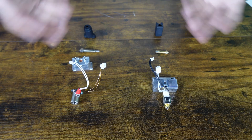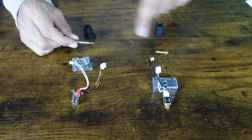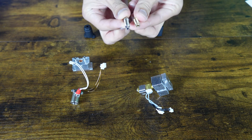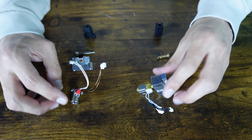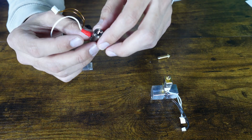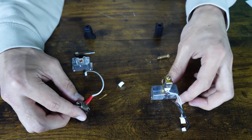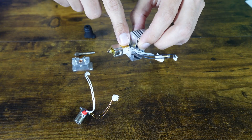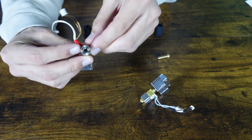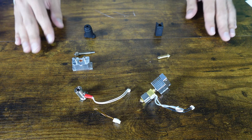In the name of science, I went ahead and disassembled both as far as they would basically go. The Micro Swiss definitely breaks down a little more, and that's due to the nozzle being combined with the heat break compared to the standard stock hotend. The heat block is a lot shorter on the Micro Swiss. I think the reason we're getting a better flow rate is because Micro Swiss uses a cylindric heater, giving even heat across the whole thing, compared to the stock hotend where a little heater block heats up the whole brass block. So the heating zone is just so much better because it's surrounding the filament as it's actually moving through.